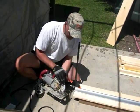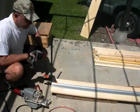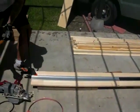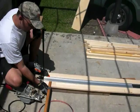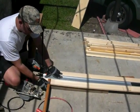In this case I'm actually coming up to the square edge of this wood and I don't want to lose any material — just want to cut off an exact 45 off that end. When you angle your blade to a bevel like this, you're actually trying to get that measurement from the left side of the blade over to your fence. So basically when I set this rip fence in place I took my ruler and measured two and five eighths inches over, held it on the line, and then clamped my rip fence in place.